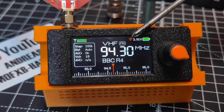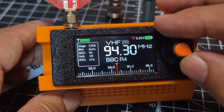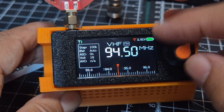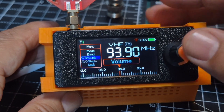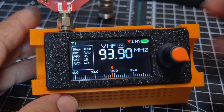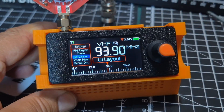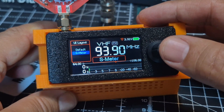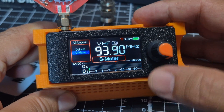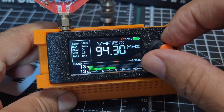We're going to show you the memory channels. You can see there's Wi-Fi and also the tuner — we're able to tune and we've got RDS. If we press and go to settings, then go to UI layout and press it again, we can go to S-meter. Let that come back and now we've got an S-meter.